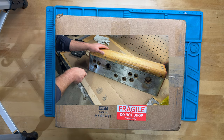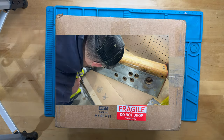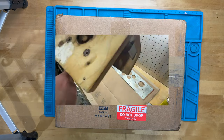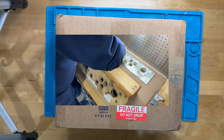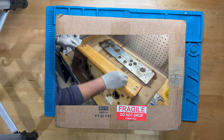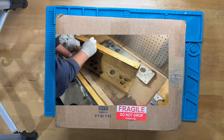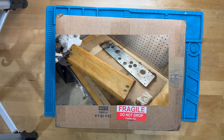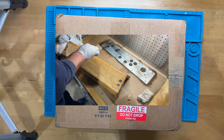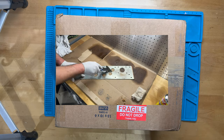It's not that big of a loss because you've seen me do all this stuff before. I took the Wells Gardner K4900 monitor, took it outside and washed it using the same technique I always do: garden hose on low pressure, some Simple Green, a soft bristle brush to loosen up the gunk and debris, rinse it off, rinse and repeat. Then I came in with my air hose on very low pressure to blow all the loose water off. It was actually raining, so I brought it straight into the garage and put it under the big fan. It's been running for a few days — that monitor is nice and clean.